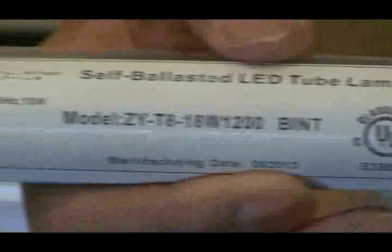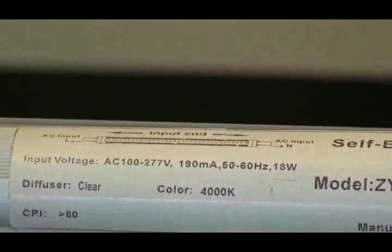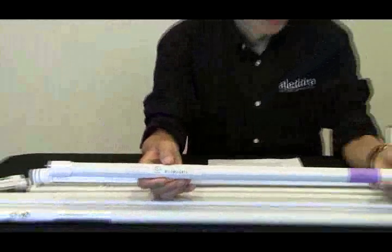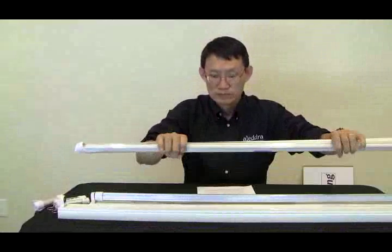You will get shocked. If I try it, I have had enough for today. If you go to its UL certification page, it gives you the part number. It spelled out double N, single N. It turned out only the single N is UL certified, even though double N is listed; it is not certified on the double N. So this one again put a single N certified UL number on a double N tube. I have to warn you, it is not uncommon to see someone do this just to get business. Be extra careful. So lesson number 1, pay close attention to the UL certification number and compare it to what exactly is certified on the UL certification page.